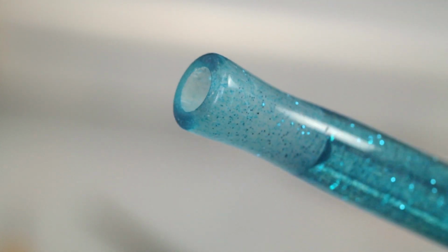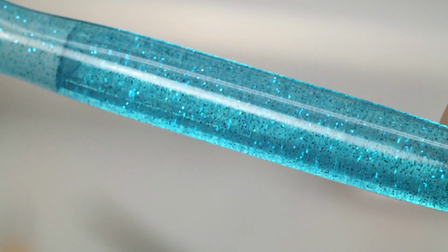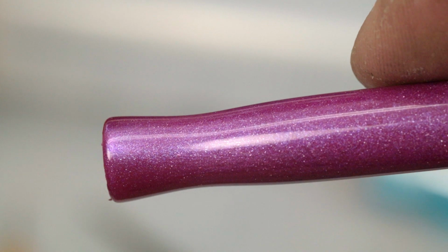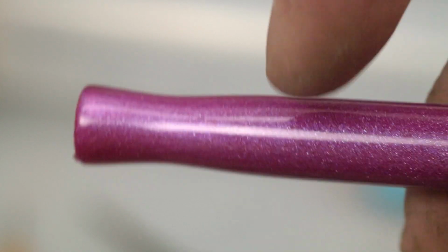Now I know you can get pen holders pretty cheap, but the problem is the plastic they're made of. I really like using acetone to clean my pens. I find it prevents rust on the nibs, but it's destroyed every pen I've ever bought. And while epoxy isn't acetone proof, it is very resistant. So for quick cleanings, it seems to have no effect on the finish of the pen.